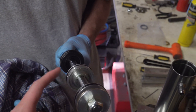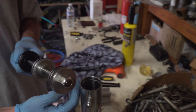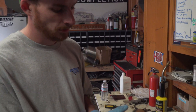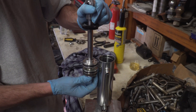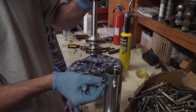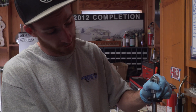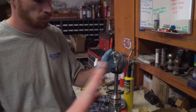The seal head is making sure nothing gets out of the shock, but it's also providing stack height. If this was fully extended, it'd be sitting inside the shock like this. Without the seal head, you'd only have a very small amount of distance inside the shock holding everything together — so with all the shaft sticking out and only a little holding it in, if something binds up or it's too small, it can walk and start screwing things up.